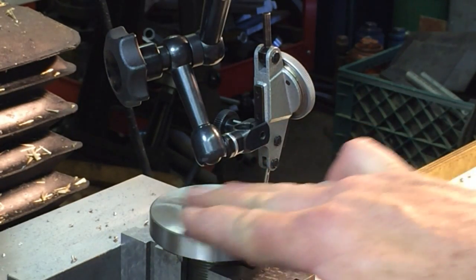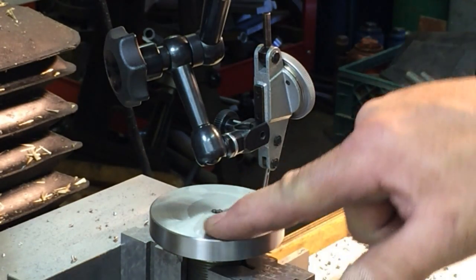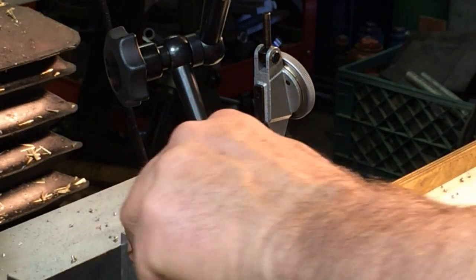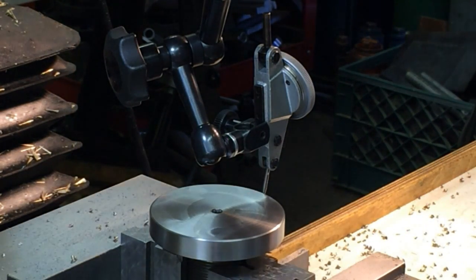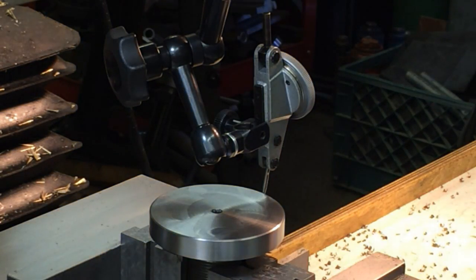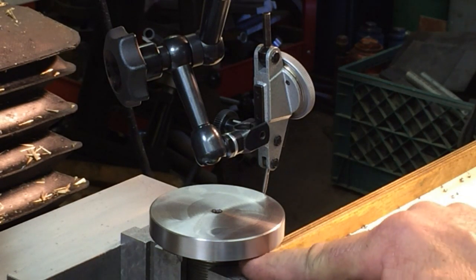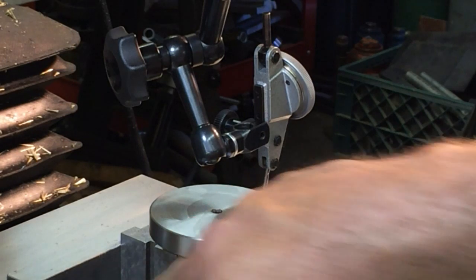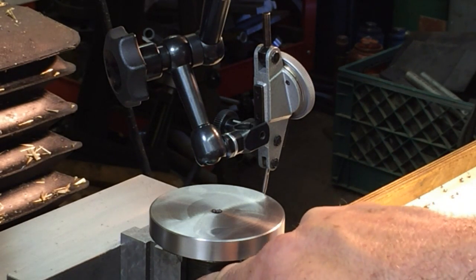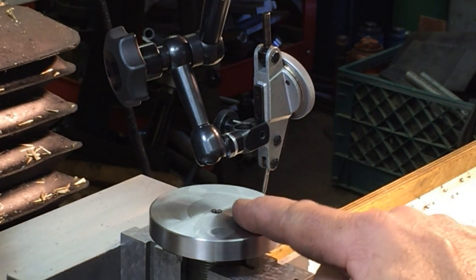This is one of the hand mill wheels for the taper attachment locking mechanism. We cleaned them up on the lathe, got them nice and round, got all those chowder marks — as Tom Lipton says — off from the old channel lock knurling tools or something similar. I have it set up here on a parallel so it's got about half an inch clearance from the V-blocks clamping on those threads. This way I usually get no damage on the threads — nice big surface area.